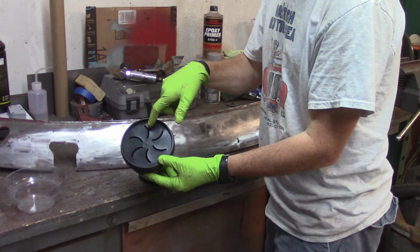So it doesn't appear that the cap comes off. It's really clean right now because I haven't used it at all, so I'm just kind of guessing that what I'll do is probably put the cap back on, shake this up, and bring the powder into the pad, and then simply run that powder over top of the surface, and then hit it with a light scuff of sandpaper, and the black powder where your low spots are will stick, and where the high spots are will get wiped away with the sandpaper. So I'm going to give that a shot and see how it goes.